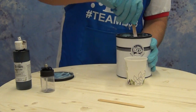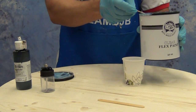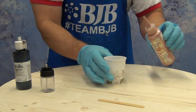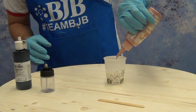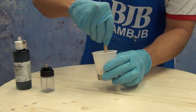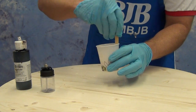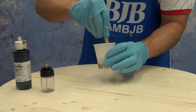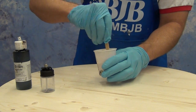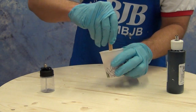Once we have our cured urethane part, it's ready to paint and finish. It's important to use a compatible paint that will bond to the surface. One of those is our Clear Flex paint — a paint base you can pigment with Poly Colors or BJB 6800 series pigments. It starts out white but dries clear and is water-based for easy cleanup. You can run distilled water through your airbrush to clean up after use. Important note: this is a single-component urethane, so as with any sprayed urethane, use really good ventilation and wear a respirator.